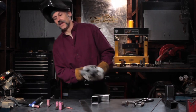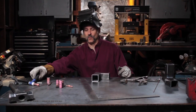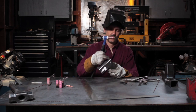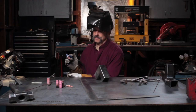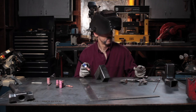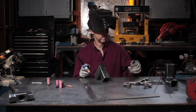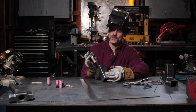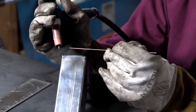In an effort to try and keep this from pulling incredibly far out of shape, I'm going to weld like we did before — the back corner first. I'm going to use a 1/16 filler rod because I don't really need to add a lot of metal. This corner is fitting quite well.